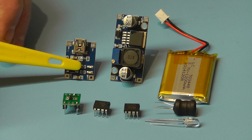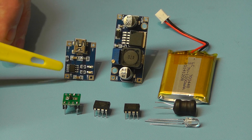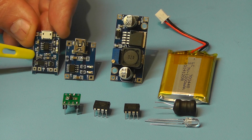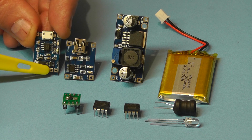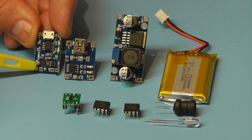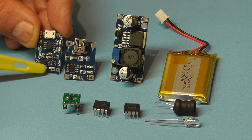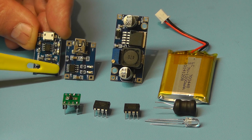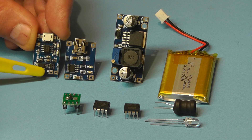The charger module has two indicators - one red and one blue. A red LED comes on when it's charging and a blue one comes on when it's fully charged. If you happen to use a battery without the protection ICs, you will probably need a LiPo battery charger module which has two additional ICs - one is a protection IC and the other is a dual MOSFET transistor - used to protect the battery from over discharging. Both of these modules are fairly cheap on eBay, between £1 and £2 depending on which seller you buy from.